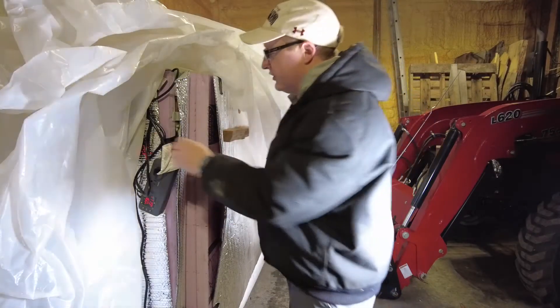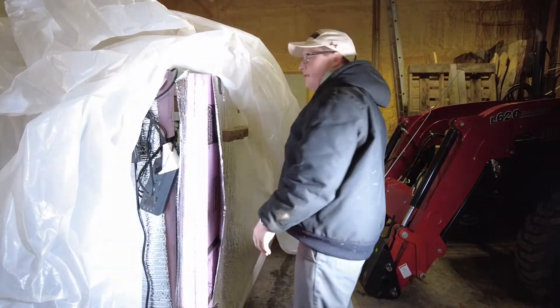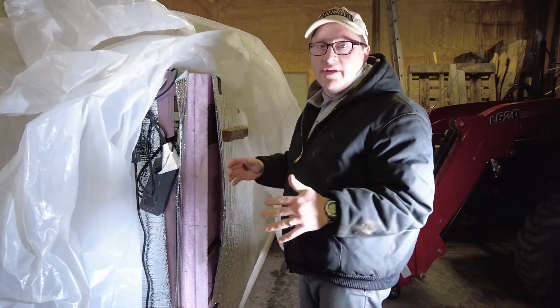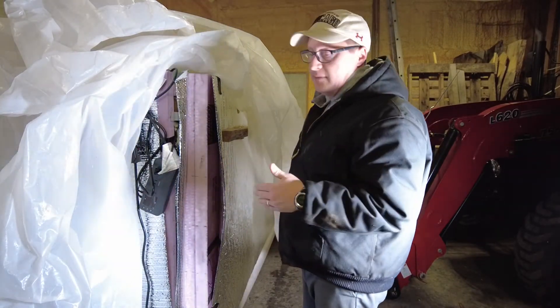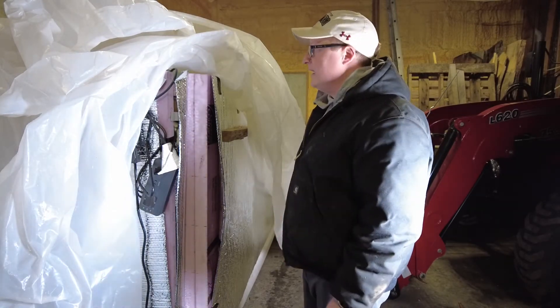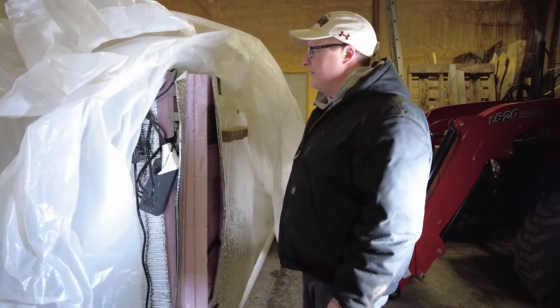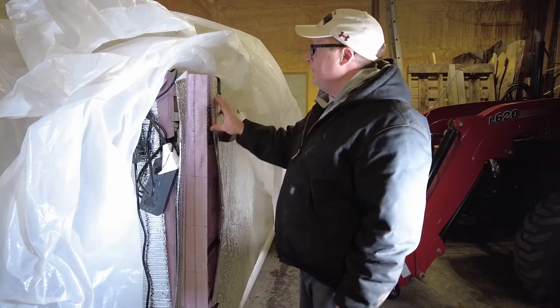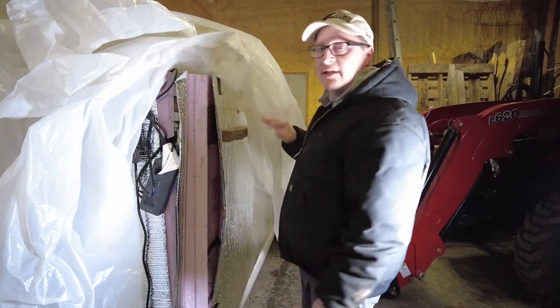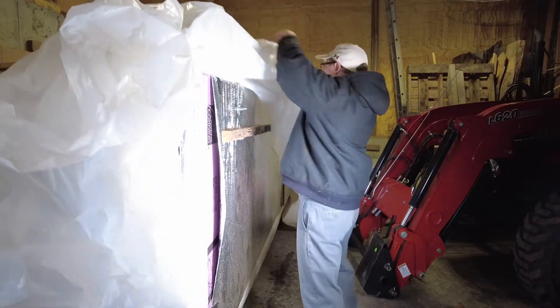It's not being used for furniture or anything like that. I'm excited to see what the buckthorn looks like, so let's get this stuff unloaded. The heater was running for one day and it went from 68 degrees to 120 degrees — and it's just a little tiny 500-watt heater, so not very big. This is a pretty big kiln, so I'm just going to take everything out.